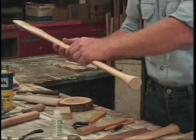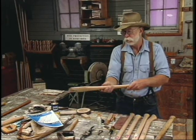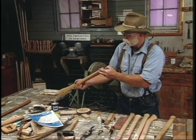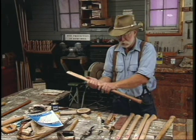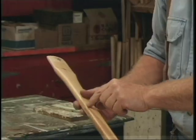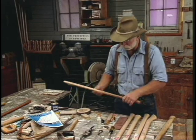It's got flats cut on it and that helps you get purchase. This other handle is also a 28-inch double-bit handle, but the grain runs the wrong way on it. With percussion and the grain running that way, it's going to pop it loose under pressure. It doesn't have a good feel to it — it's also got shellac on it instead of wax like the Link handle. And it's got heartwood in it. Good hickory handles should not have any heartwood; they should only have the sapwood. You can see the transition between the two here.